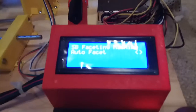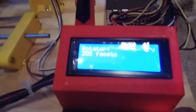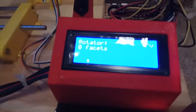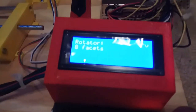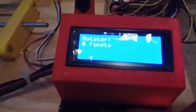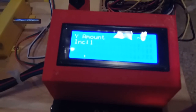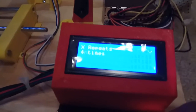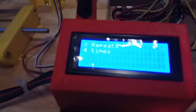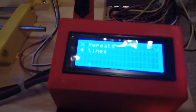There's an auto-facet mode, which is pretty neat. You pick how many facets you want — let's say 8. You can go up and down to pick more or fewer. Then you set how many increments — that's how far it moves each time; one is very little. Then how many times you want it to repeat in X, going back and forth — let's say two. Then the Y repeats, a couple of times.